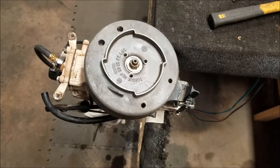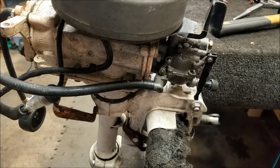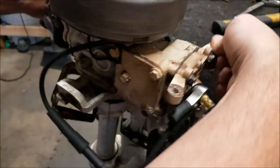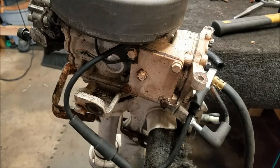We've got compression and spark. We'll need to clean up the carburetor just for safe measure, and we'll go check the lower unit to see if it's liquid cooled — I'm sure it is. We'll see what an impeller costs, and we'll look at the rope start parts. Also, just so you know — there are no provisions here for an external fuel tank. There's no plug for a fuel pump on either side, so something to keep in mind. Some people like the built-in tank, some don't. If you've got a small canoe with limited room, you probably don't want the built-in tank, but there are no provisions for external fuel on this one.